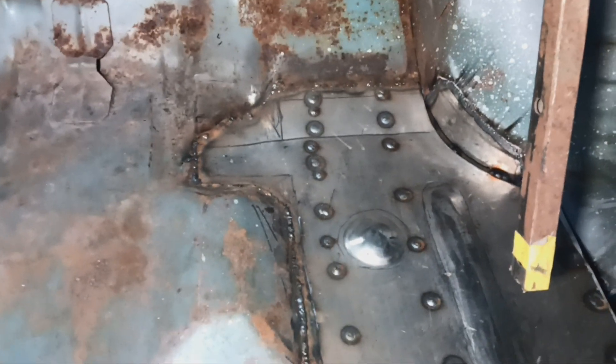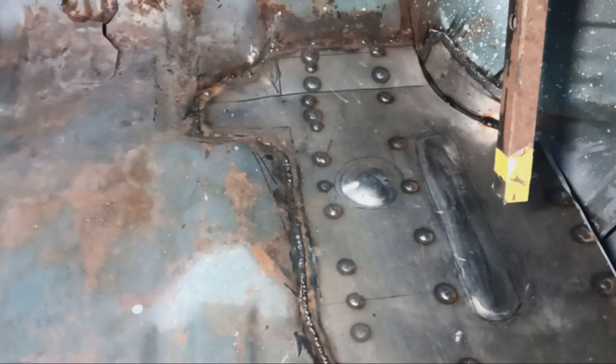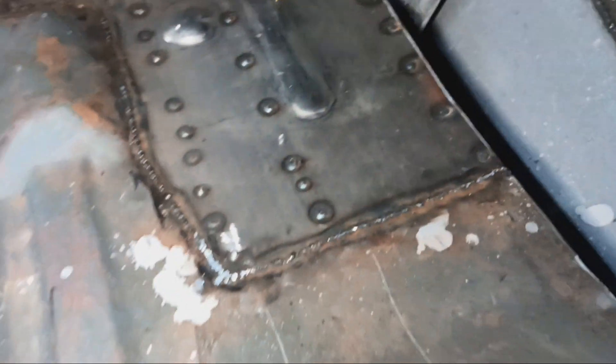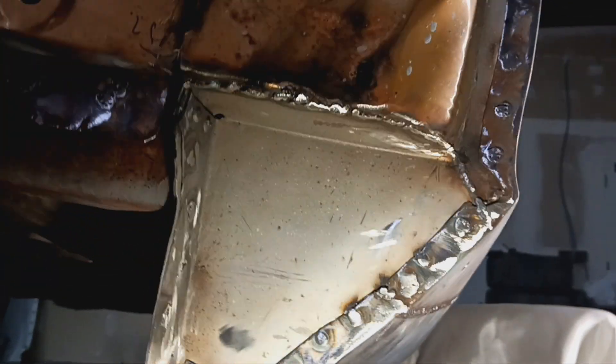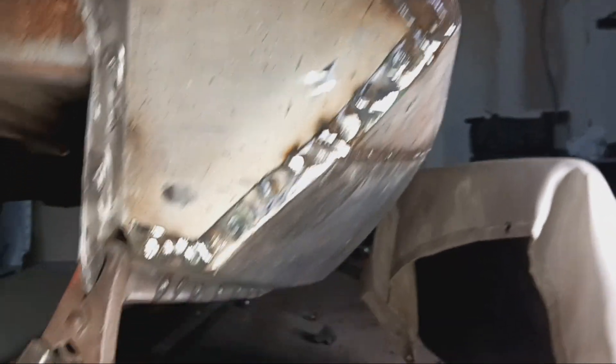To make that section out of just good old-fashioned flat steel, 18 gauge — I actually sectioned in part of the brace that's under there on the inner wheelhouse. The passenger side of this thing is done. I've got to come through and dress everything, spotlight it, make sure I don't have any pinholes — because up at the top there I had a pinhole somewhere that I plugged in and stitched in.